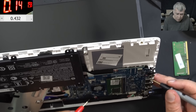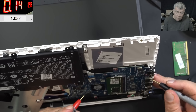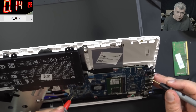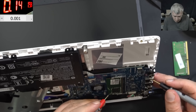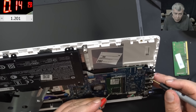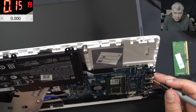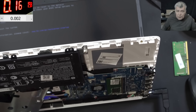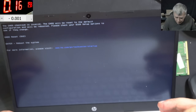Let's check what voltages we have. Here we have 1 volt, then 1 volt, 3.2 volts. On the RAM memory we have zero, then 1.2 volts. So we have around 140 milliamps constant current. We have picture! That's crazy - so actually it's working.